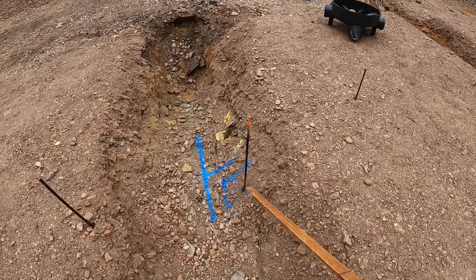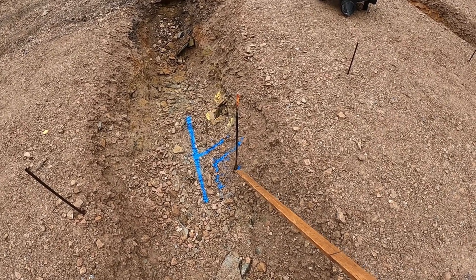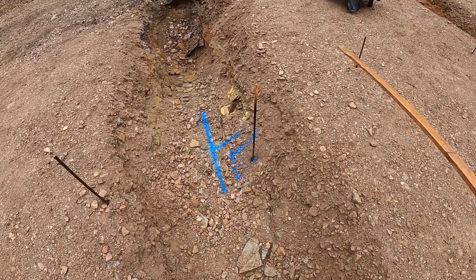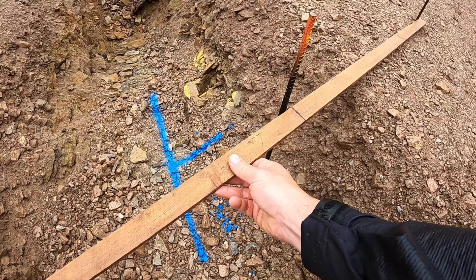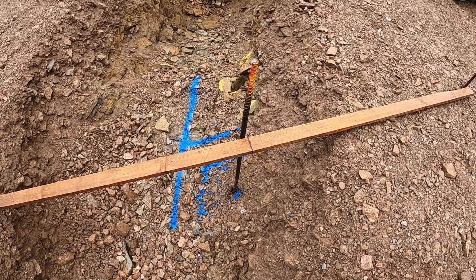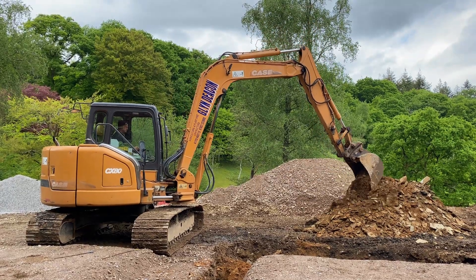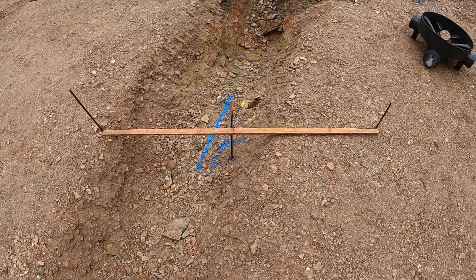You'll notice here where I've got the X and the Y for the soil pipe swept bend - the exact location. That's going to be dug out by Glyn and his bucket so we're going to lose that marker. So what I've done to ensure I can get the exact location again - because this is now verified by the surveyor - is I put a pin here and a pin here and I've used this measuring stick. We're just slightly out by about 10mm but that's within tolerance. When this is removed, all I have to do is use that measuring stick to pick up the centre X and Y, and Glyn's not going to be touching those two pins either side with his bucket.